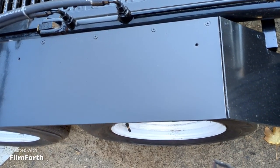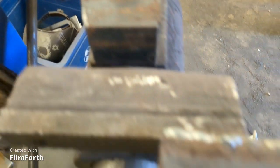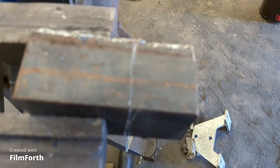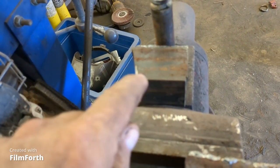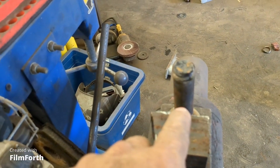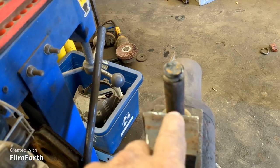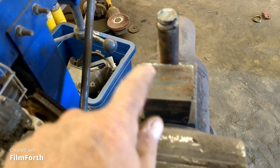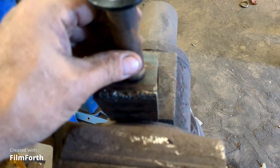Here's our angle iron — I cut one off the other end, and I'm going to cut this last one off here, cut this block off right here, and make this piece the same profile as that piece. Then I'm going to drill a hole in it with a drill press, and then I might have to use a die grinder to open it up a bit because I only have a one-inch drill to drill that hole through the top.